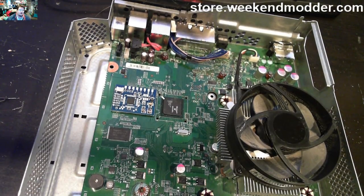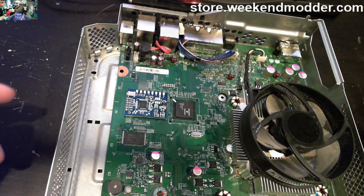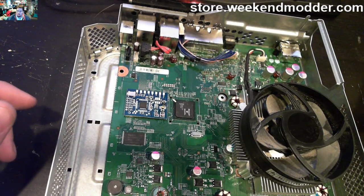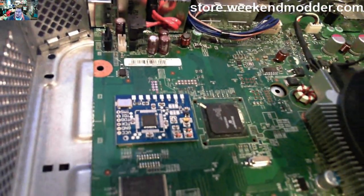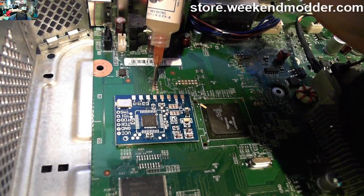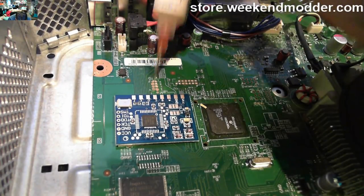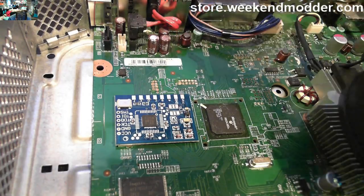J Runner can't always automatically tell the difference between a 16MB and a 256MB NAND, but that generally doesn't matter. We've used our scratch pin to take the coating off the top, and then we'll apply some flux paste and get the NAND point soldered up.